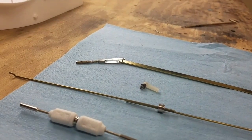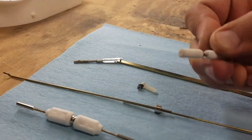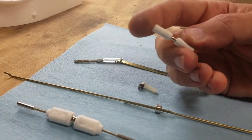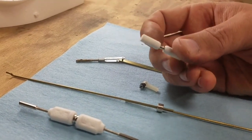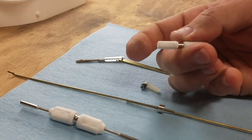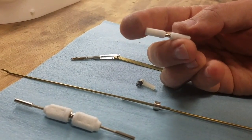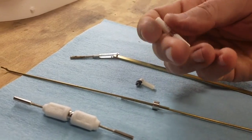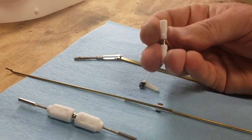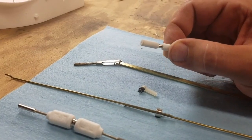The last one is the solution that David Merriman came up with and I really liked it. This is a new version of it that we're selling at the Nautilus Dry Docks. These are plastic parts and they've got magnets embedded in them. We've got two sizes — one is for the smaller models and they use a one-eighth inch rare earth magnet. These are really good for smaller models that aren't going to have a lot of force. You're going to want to make sure that all of your linkages are very free operating. Installation and removal of the cylinder is a snap — it's absolutely gorgeous.